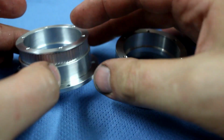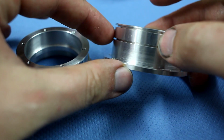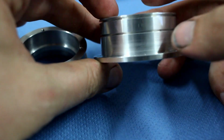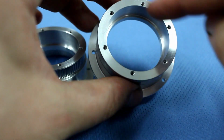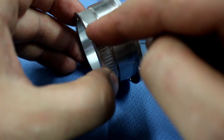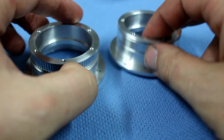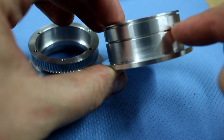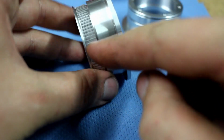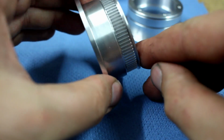Okay, that's one of the parts we prepared early on the lathe. I'm not entirely sure how much of it I filmed. But basically, this is what comes off the lathe and just got some holes drilled into it, nothing else. But the drawing specs out an HTD timing belt profile in this area that we grooved off with two grooves or sectioned off. And this is the result I got.